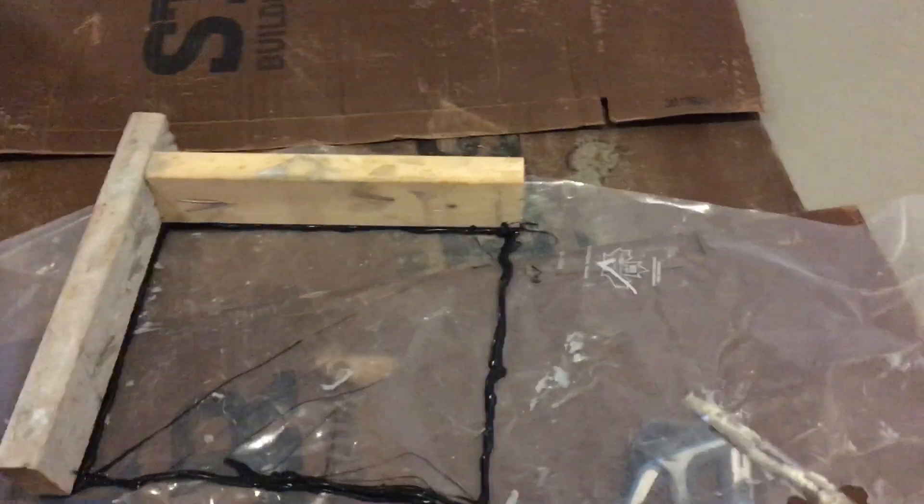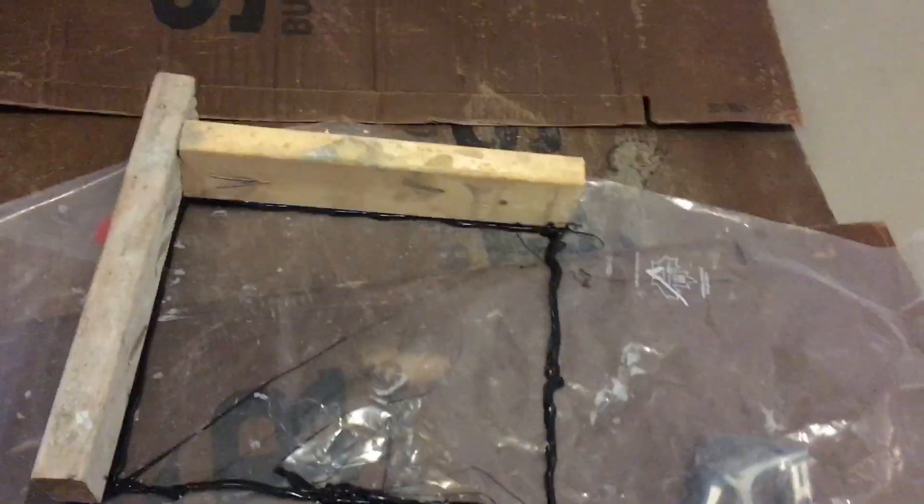Normally I've spray foamed onto poly, and I forgot to unscrew my valve. When I pull on the poly, I can tell that it comes away from the spray foam, and you can have an obvious leak there if it ever comes away. You never know if something's going to shift and cause it to delaminate, as they call it.